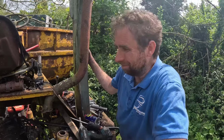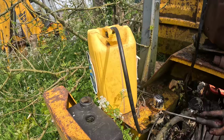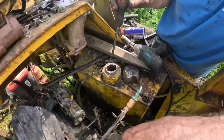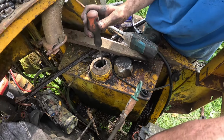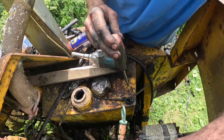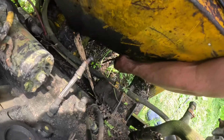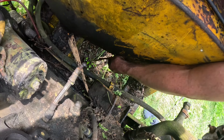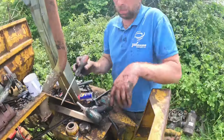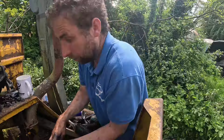She's free. We've rigged up the fuel a bit different. You look over here, we've got the tub of fuel directly piped into the pump, because this fuel tank here has got stones in the filler, which isn't ideal. This breather has been open for the last 10 years. The fuel does come out if you push it down, but I'm not sure whether that's fuel, water or what. It doesn't seem to want to pick it back up. So I'm hoping, because that's a bit higher, once we get it going, it's going to start. So we're going to turn it over now.